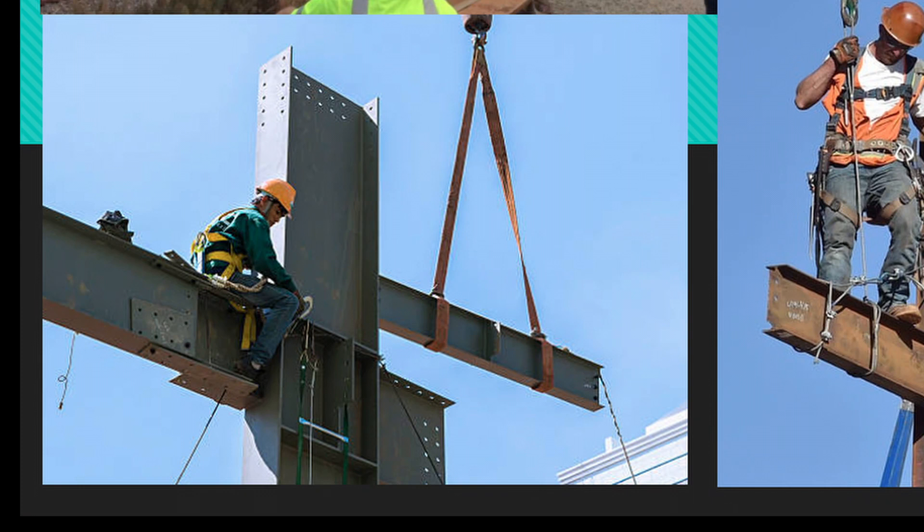Lifting should be implemented as per the following specifications. Tying ropes should be provided at both ends of the member to be lifted. For larger members, a protection sleeve shall be provided to prevent surface damage by sling or shackle. The sharp portion shall be covered to avoid sling damage. Grating lifting should be fully secured, tied, and offloaded on the structure at an accessible area with full closed platforms — temporary or permanent — prior to distribution. All lifting operations shall be carried out by a qualified rigging foreman and rigging crews.